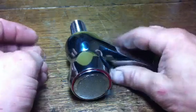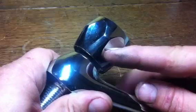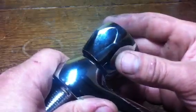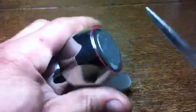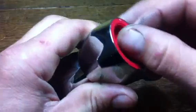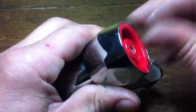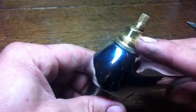Okay, so we're looking at taps and tap washers today. Basically, with a tap, mostly you have to take the head off. Now, that can occasionally be a bit tricky. With this particular one, we're looking at getting the cap off it first. And under here is a nice little screw. The screw comes out, and you're left with the body of the tap and the insert.